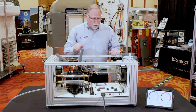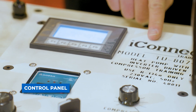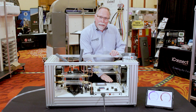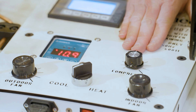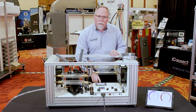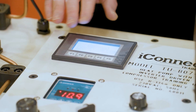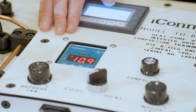Now this is a really cool setup. Down here we have a control panel that controls the speed of the indoor and outdoor fans, but in addition to that, you have the ability to control the RPMs of the inverter compressor yourself. We have a complete readout of the RPMs of the compressor, of both fans, and we have an EEV on there so you can see the superheat and the pressures.